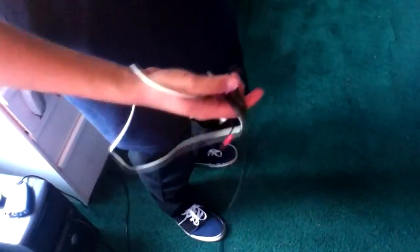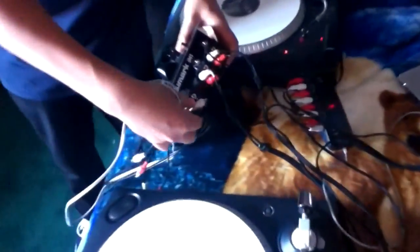Alright, this is the third cable that you're going to need. I made this cable right here because the Maya 44 doesn't have a recording capability. So this is an RCA cable, male on one end. From here, I joined them together and pulled another RCA cable — so it's basically one end and then it splits to two RCA cables. And from there, I run this on the output of your mixer, so just connect it.